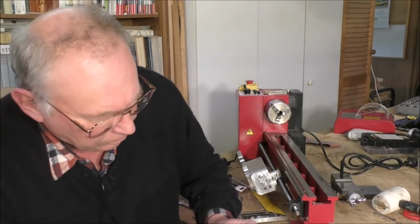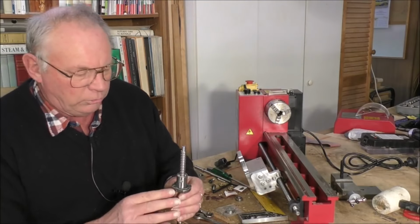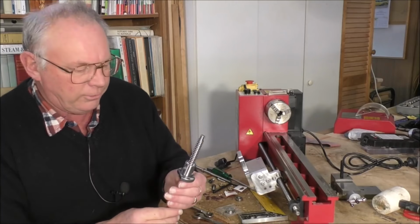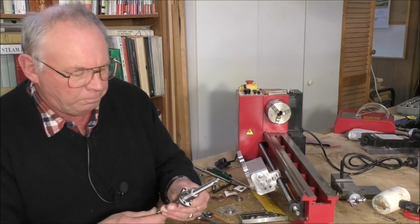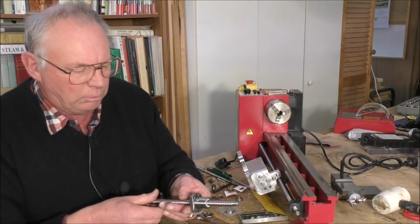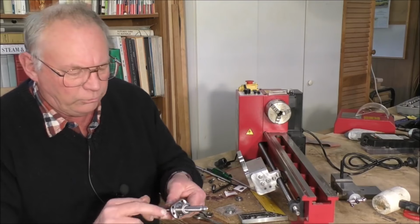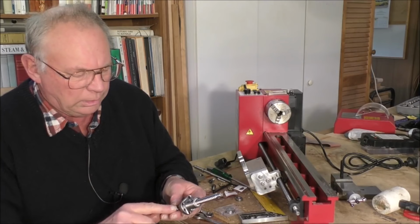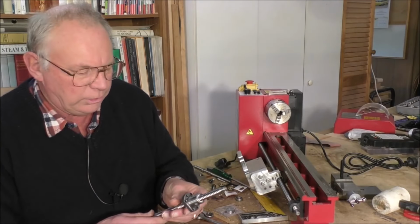Now this is very, very hard steel. What I normally do is I get a slitting saw, and I take it off with that rather than put it in and mill it off, because a milling operation would take a minimum of 3 milling operations, and providing you don't cook these up, because there's nylon parts in here as well, so you've got to keep it cool and do a little bit at a time. And I think I can grind that off quite successfully.